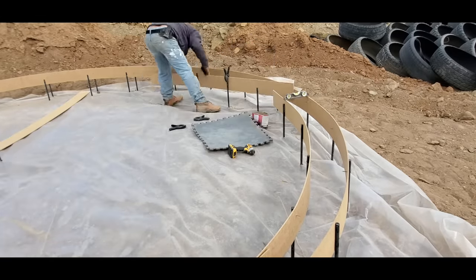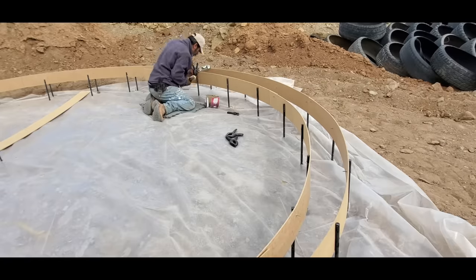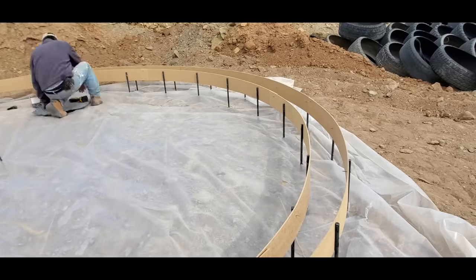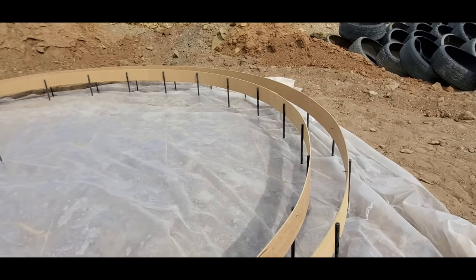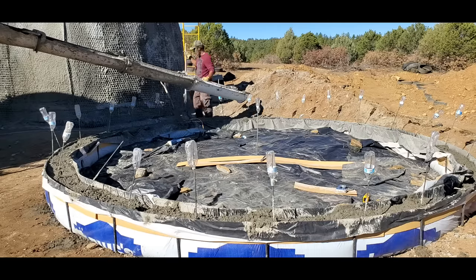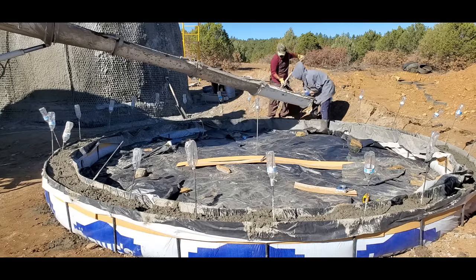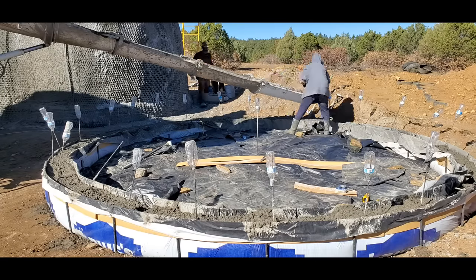A lot of that is thanks to the airform. There are commercial airforms you can buy that are reusable up to a hundred times. The airforms I'm making are one-time use and it's a low-pressure system, unlike commercial high-pressure reusable airforms which are very heavy — you need a crew to open them and mount them to the foundation. With these airforms made from Tyvek, one person can do everything themselves, which is really important when you're building your own home to save on labor costs.